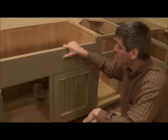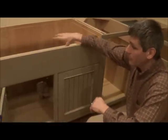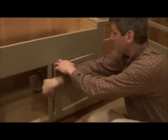To support your sink — we haven't cut it out yet — we do have our platform in here. This is going to be a big heavy granite sink, so let me show you what we've done inside. We put some really thick inch-and-a-quarter angle iron across, supported by three-quarter pieces of plywood standing upright — one in the back, one in the front — and then a three-quarter plywood plank across the center. This sink is going to be upwards of 300 pounds, so we want to make sure we've got it reinforced.